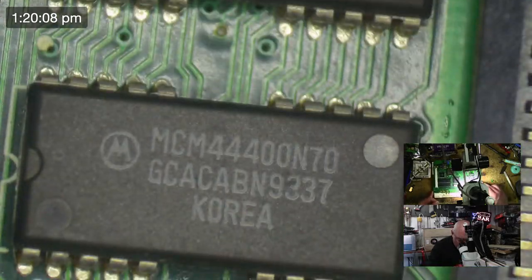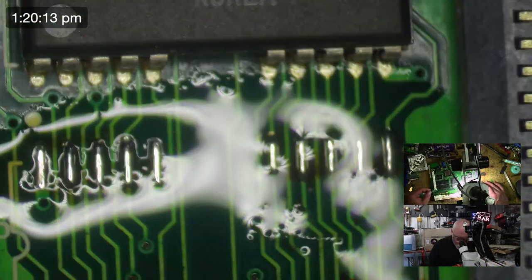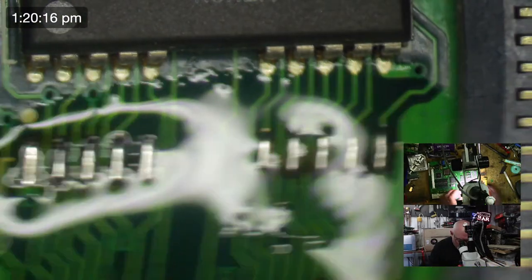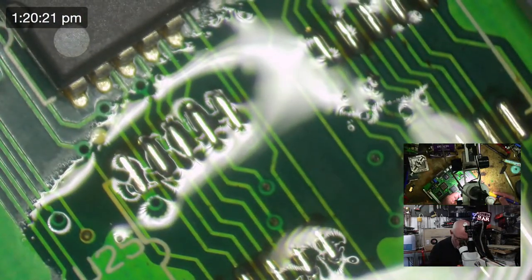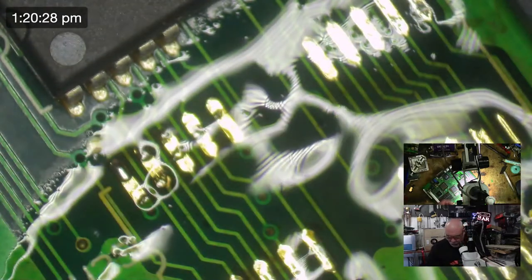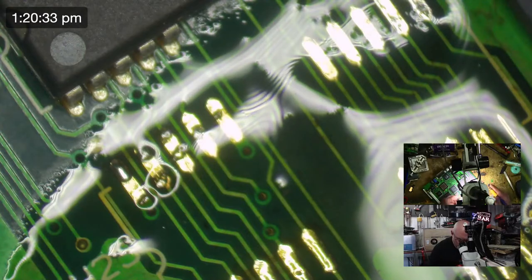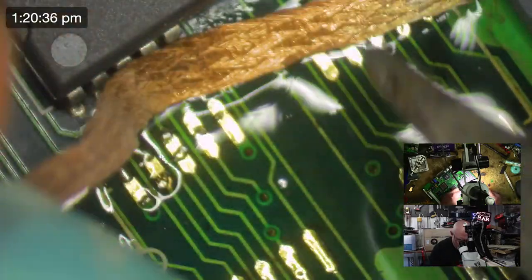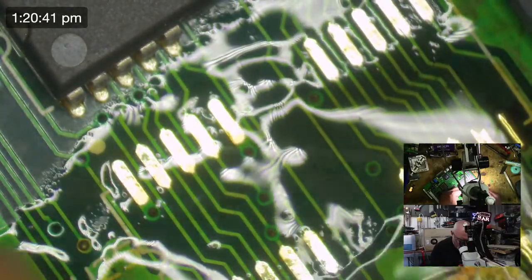So one of your LC 575s, I've looked at three of your boards. One of them is working perfectly. One of them I consider unrepairable, or certainly not worth repairing. And then there's this one here, which we're very close on. You know, the Mac is ultimately telling us what's wrong. It's saying it's failed a RAM check. I just tried to do a RAM check and it failed. So when a computer's telling you that, it does make life a little bit easier. You can sort of say, well, maybe it's the RAM.